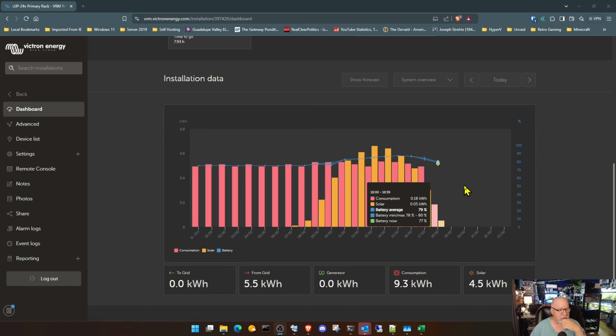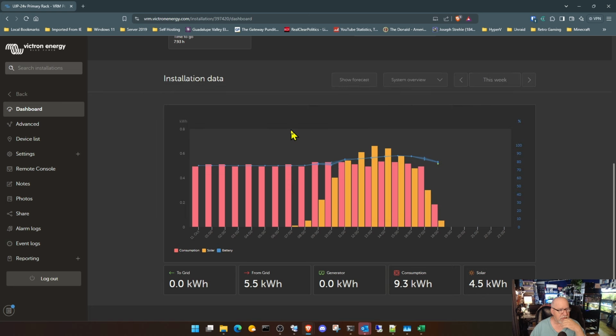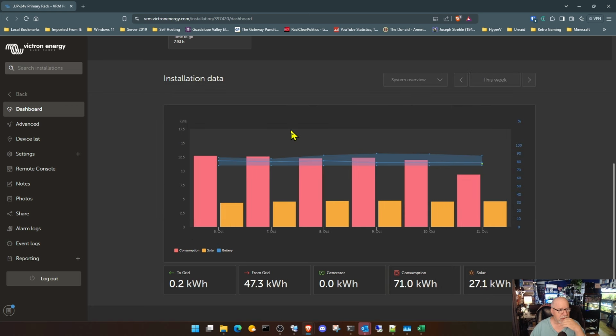in an hour. So if we change this chart to this week, we'll see that I have produced about 30 kilowatts of solar, but I've consumed 71 kilowatts in total power. So I've consumed 47 kilowatt hours from the grid since the beginning of the week, and only produced 30. So I'm making about half. I produce about half of what I consume. So